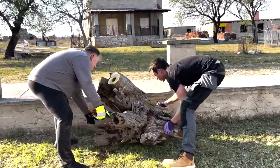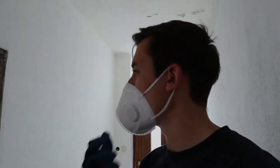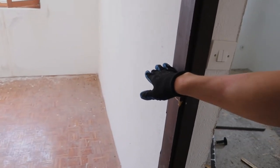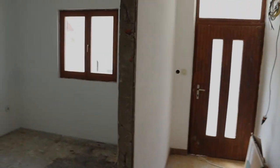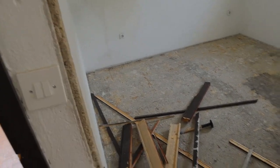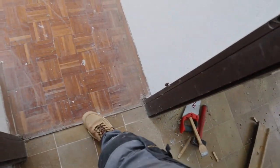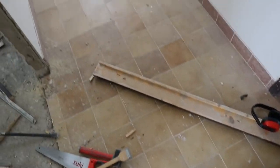On another episode of 'let's pretend I know what the hell I'm doing' — just removing some door frames. Started off by taking these borders off, then cutting through the wood here and just hammering them through and using the crowbar so it's taken off with the least amount of damage. Needed to get these off not only because we're changing the doors but because these metal frames need to come out so we can remove all this hallway tiling.